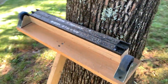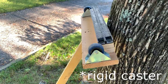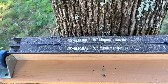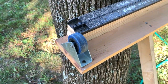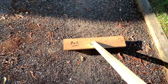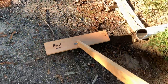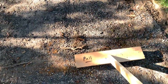What I did was I just took some scrap wood, put a caster on each side, and I think these were free magnets at one time from Harbor Freight. What I do is I take the handle and pull it along on the wheels where the cars go, and if there's any kind of metal — nails especially — I'm going to pick it up.